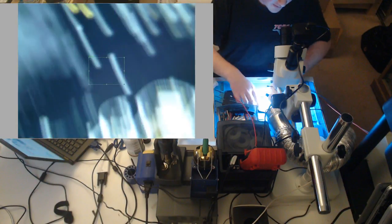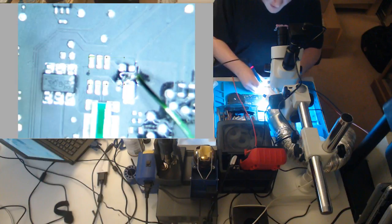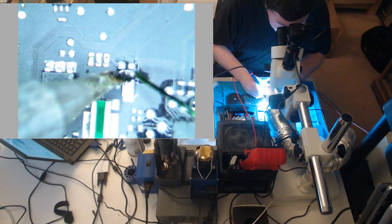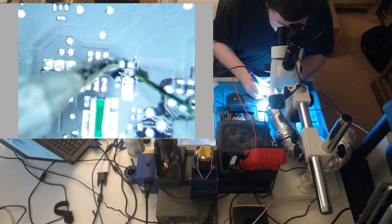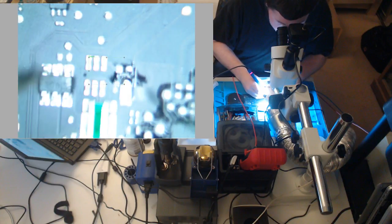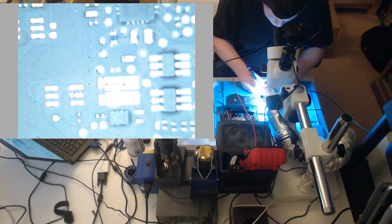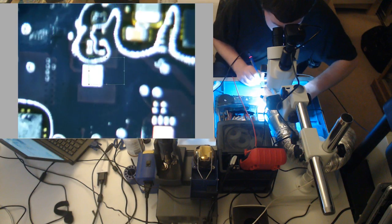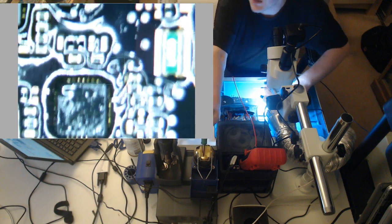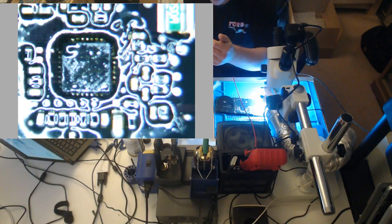something is not right. It could either be a bridge. When I saw that jumper, I said we have a high probability of a bridge. Well, my guess is that it's bridged to ground under the IC. So we're going to take it off and look. It's very possible that it's bridged under the IC. I've had it happen once. It's not all that common, but it can happen, and then we'll worry about running our jumper again after. So let's pull the ISL off again, and let's have a look underneath and see if we can find a bridge.